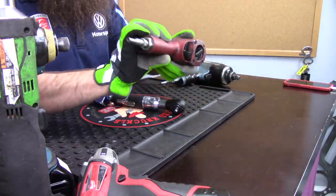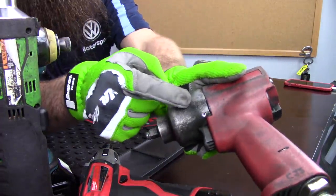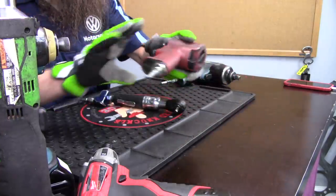There's also more maintenance. Now that can be a good or bad thing — generally people oil their air tools every day or every other day. There's also a little port in most impact guns to oil the hammer as well. Some people view that as a good thing; you can take better care of your tools. Others say that's just one more maintenance step that with an electric tool you don't have to worry about. And again, they're not portable — you're stuck at a location that has shop air for these guns to be any good.